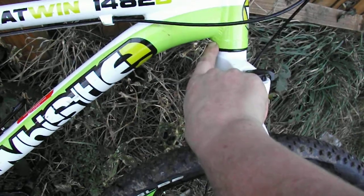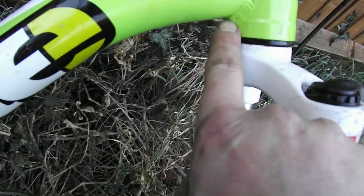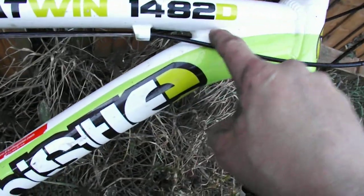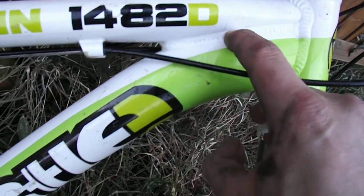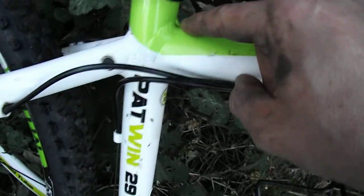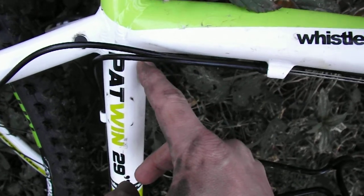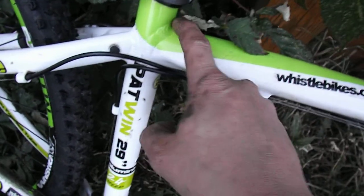The welding — there's a crater, and there could be a microscopic crack on here, so the welding's not the best. This section is quite neat until we get to around here where you can see there's a bit of burn-through by the looks of it. There's a stop-start right there. If I was welding this I would weld it up and over and do the stop-start underneath if I could. He might have just run out of filler wire and been caught short.